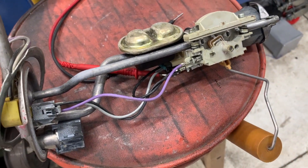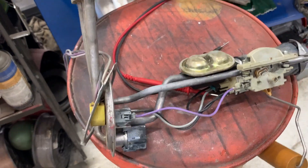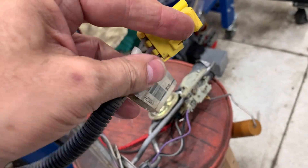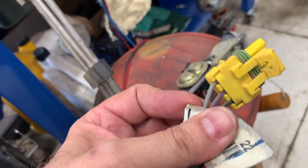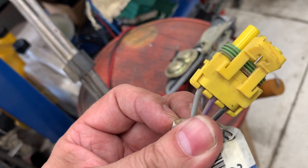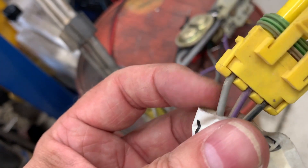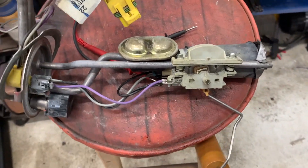Hopefully that has helped you in some way. If you're ever wondering, this is the connector that sits poking out dangling down in the engine bay — three wires here. The purple one down the middle is the reading which goes back to your gauge. The black one is common ground for the pump, and the gray one is the power wire going down to the pump.